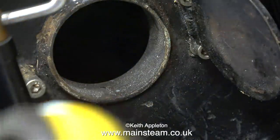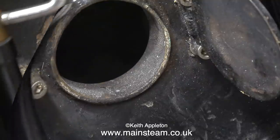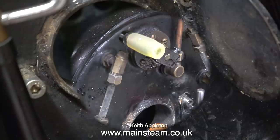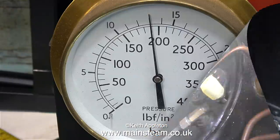The first thing to do with my small torch — you can't see it very well but I can — is to look in the fire hole door. Finding a water leak in the firebox is serious, but luckily this one is bone dry. As the pressure was ramped up to 180 psi the water gauge gland started leaking, so this was an easy fix — I tightened the nuts.